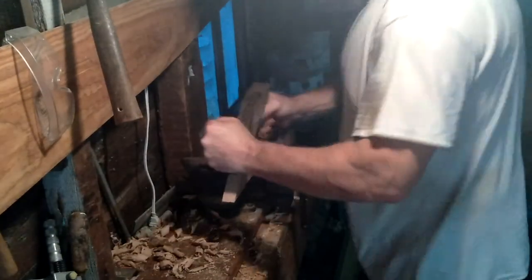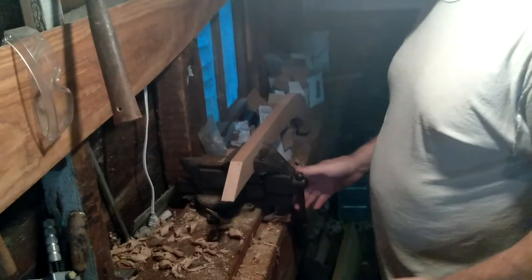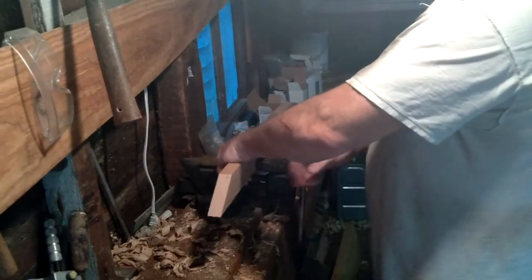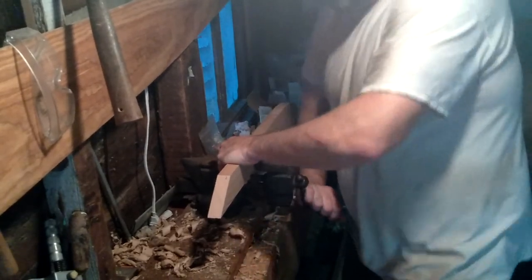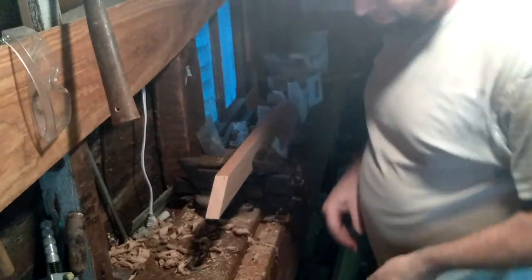than an Alpha Dory, which is essentially a double ender. But the big bonus with the Alpha Dory is you can put a lot of weight in it, and that'll set it down in the water, but that transom's not going to drag. Whereas if you're in a more modern boat with a wide stern, you put five people in it, that big flat transom gets down in the water, and all of a sudden you're dragging half the bay behind you, and you're not getting up on plane, because those planing boats rely on light weight for their performance.